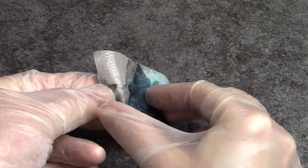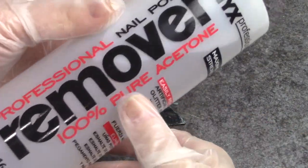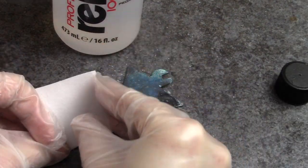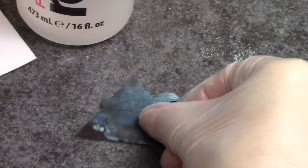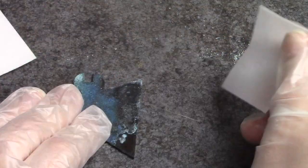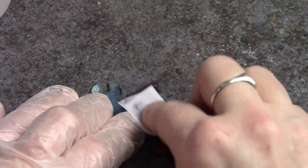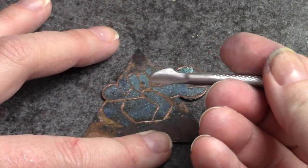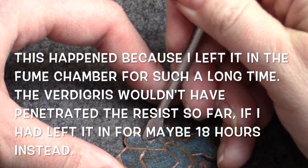This takes a long time — two days later, after a day and a half, you can see it looks crusty and disgusting, but that's on purpose. It took about a day and a half to reach the color I was looking for. I let that goo dry into a crust on it. Now I'm using acetone to remove the rest of the toner and marker that were acting as the resist. I remembered why it's a good idea to buy nitrile gloves instead of vinyl, so I took off the gloves and finished up — I was only really trying to protect my fingernails from the ink anyway.